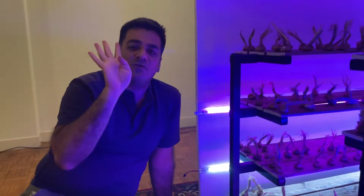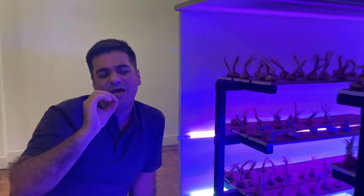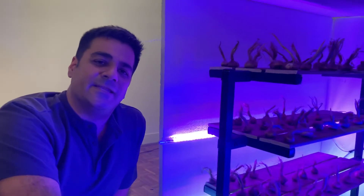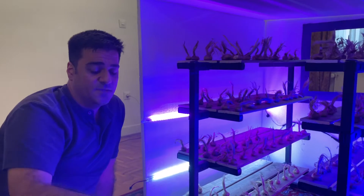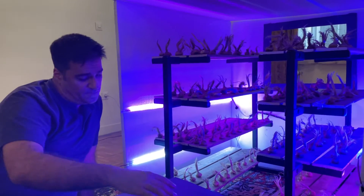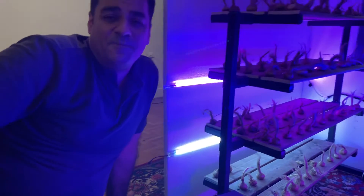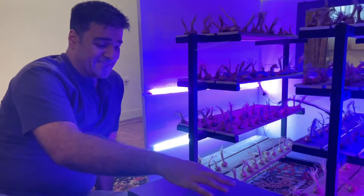In the saffron farm, we must control four factors — the most vital is temperature. I always tell my students: first is temperature, then humidity, then light, and then CO2. With this air handling unit device, we can easily control temperature and humidity. For CO2, we can use the damper to regulate it. The base CO2 range is between 600 to 800 ppm.